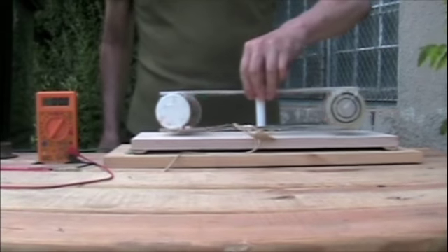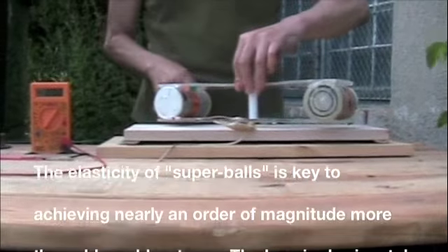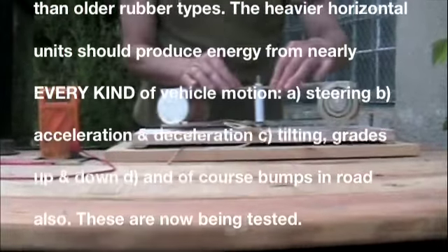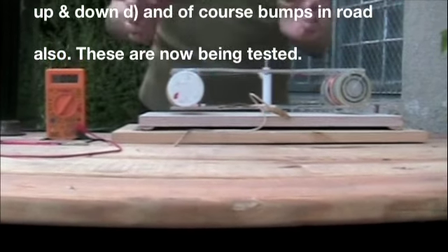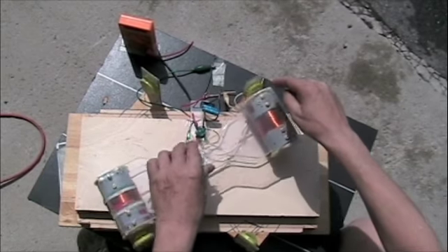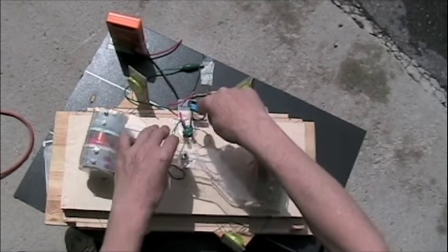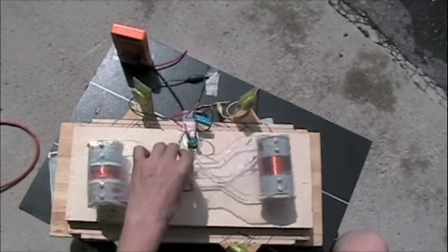You can see the pivot makes a lot of difference. If we have super bowls here and it careens against the super bowl on both ends at the same time, then any slight motion in your vehicle — whether you take off or whether you're at an angle — you can see how easily it turns on that pivot. It will drive these back and forth like a pinball machine. These are the super bowls which catch the thing, and the magnets inside are sliding back and forth. This is the full bridge rectifier of three amps, and these are three capacitors to store the energy as direct current.